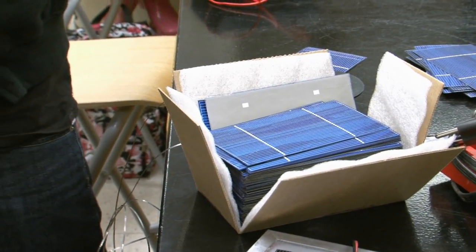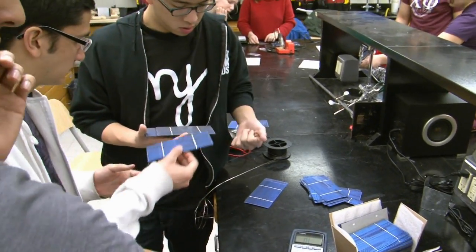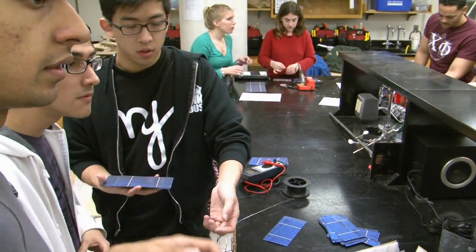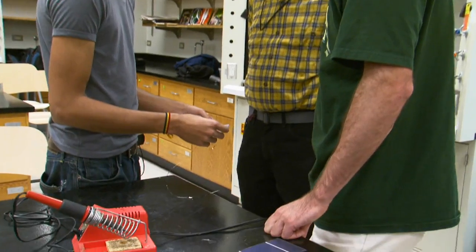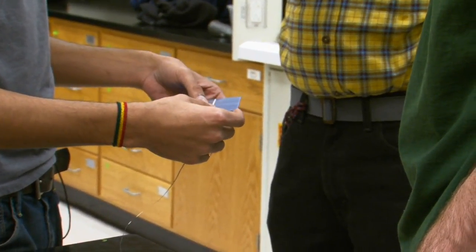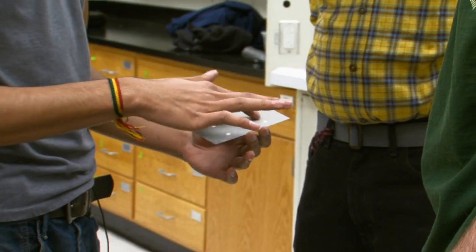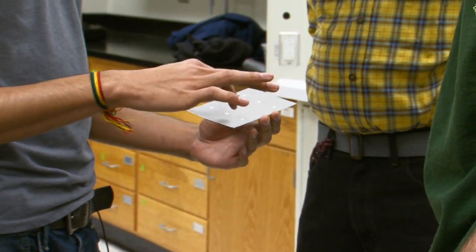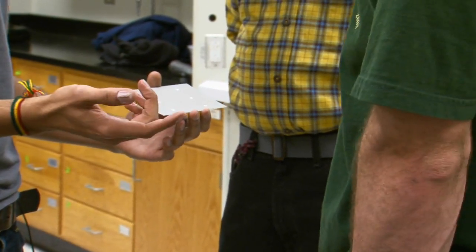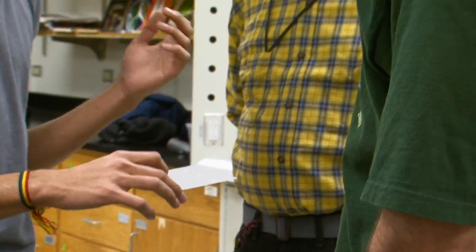You're not actually soldering directly — you don't want to overlay it. So these three contacts will be parallel. The way you would generally do it: cover a little bit of it and solder to that. The back is also all conductive. The only reason the tabs are there is because they're easier to solder to — it's just more convenient. You don't really need to solder to all of them individually.